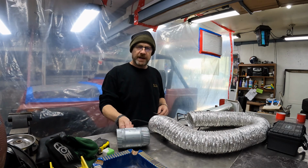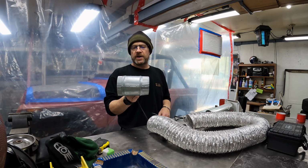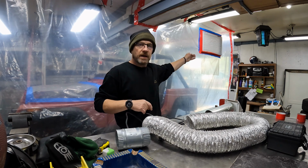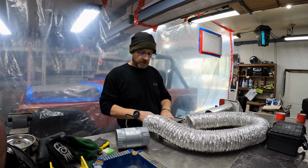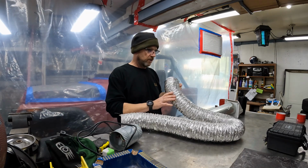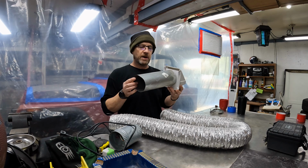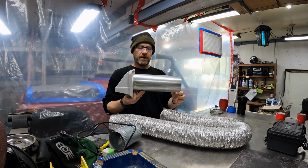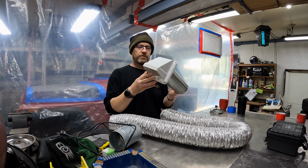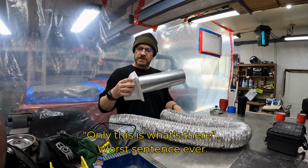Okay, so exhaust air. Here's my plan. This little 4-inch inline fan, Suncourt Incorporated inductor inline fan. I'm gonna attach that at the opening that goes outside. Fortunately, we have an outlet right up there so I can plug right in. Then the dryer hose, the other end of which is gonna be hung to the ceiling, I'm going to attach to this guy, which is what's going to stay mounted, so I can quickly connect and disconnect. Now, air is intended to run this way, so it's got a flap here, so I'm going to rip that flap out because I don't want to block the air from coming through. I might in fact just take this entire thing off so that only this is what's there, and I can quickly connect and disconnect.